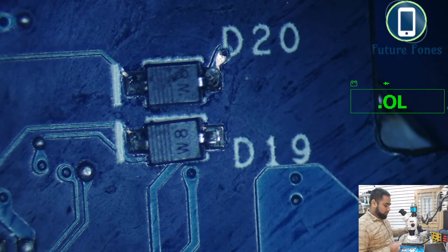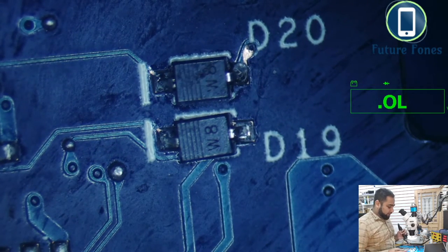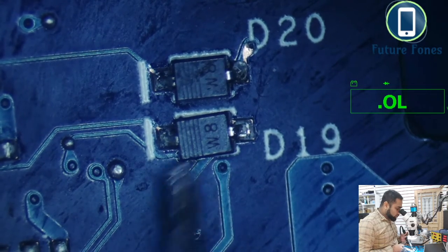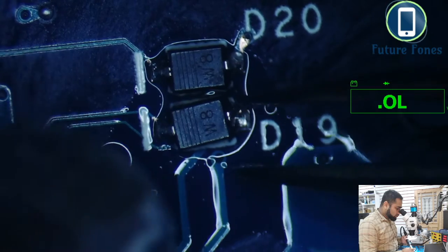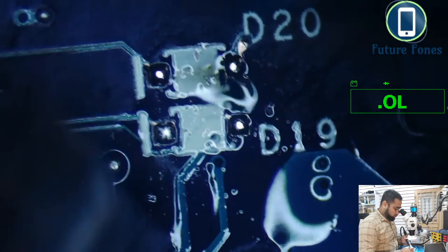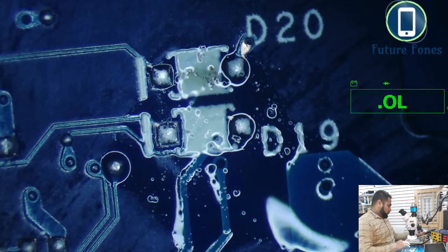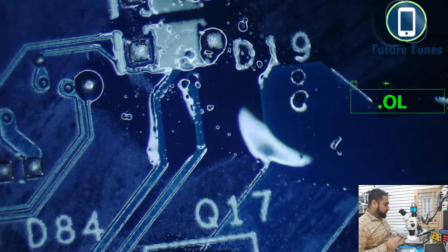What I want to do is remove these two diodes and check if that voltage is coming here, which is 3.3 volt and is supposed to come from Super IO. Insert the power, fan is connected, power on the laptop, and the laptop is powered on now. You can see the fan is spinning. Okay, it's not spinning anymore.